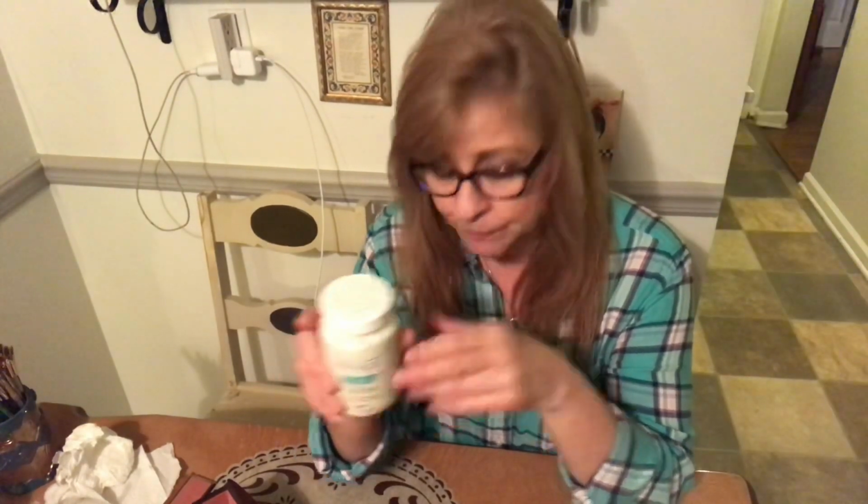All right. Now, my favorite chalk paint that I like to use, you buy it at Walmart. It's called Waverly. And this particular color is called Plaster, and it's like an antique white color. And I love it. I also bought another Waverly product, which is a wax. Normally when you use chalk paint, after it dries and has time to cure, you're going to want to go over it with wax. It's a wax made by the same company, and you put a coat of wax on it to protect it.